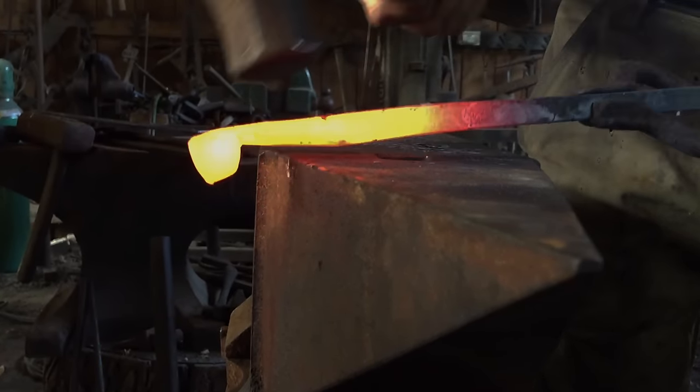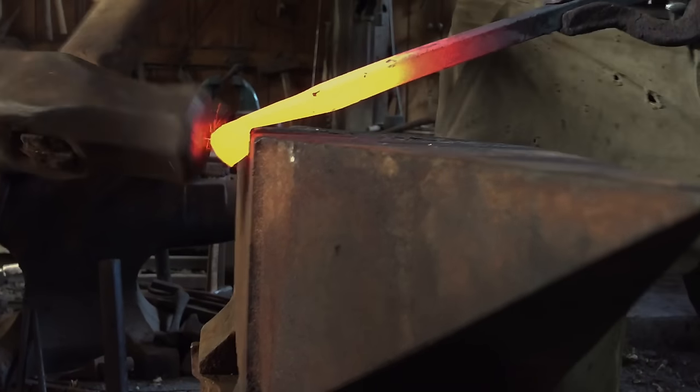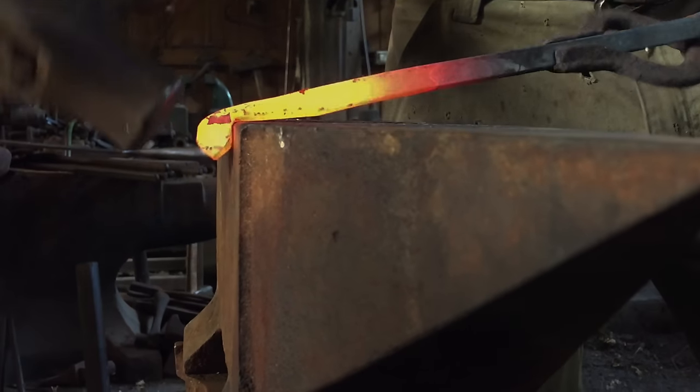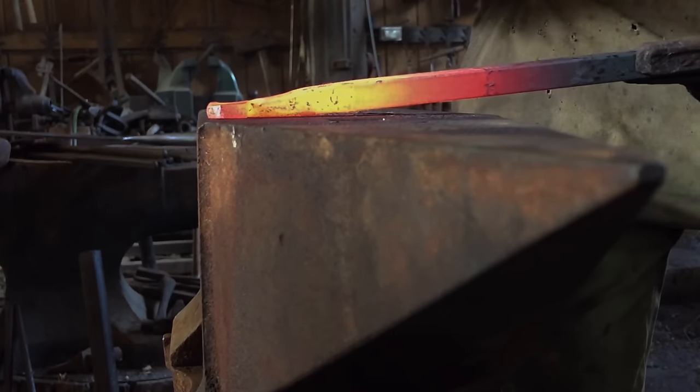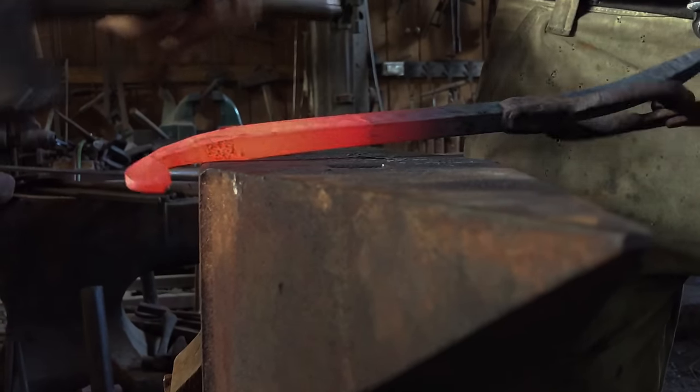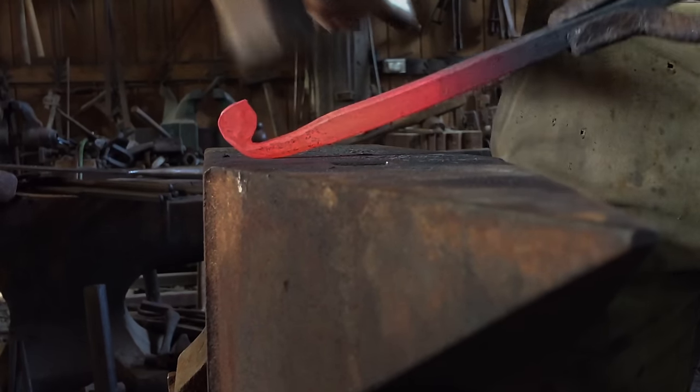You take that square and move to the side of the anvil to make something similar to Eye of the Cat. After that, you roll the Eye of the Cat in on the tapered portion and hit the point. That way, the eye turns into a circle.